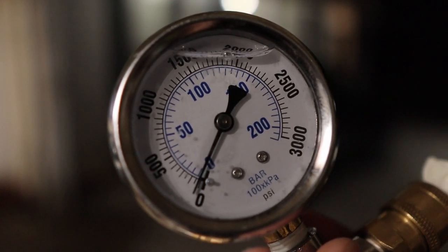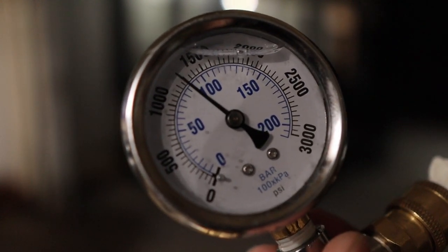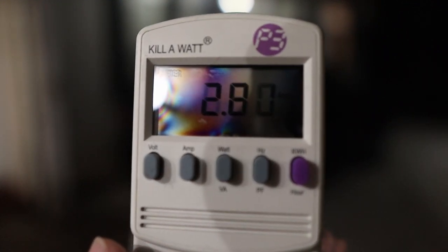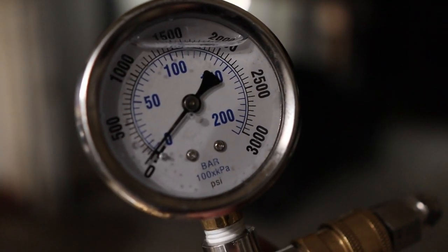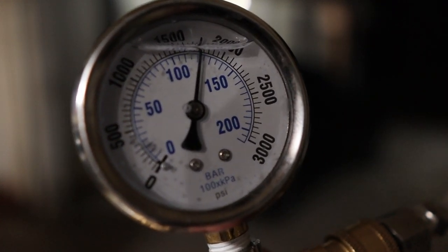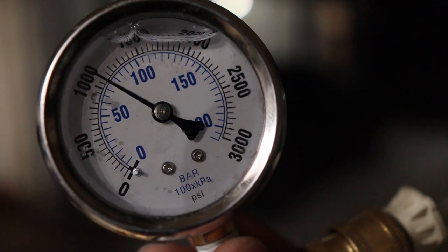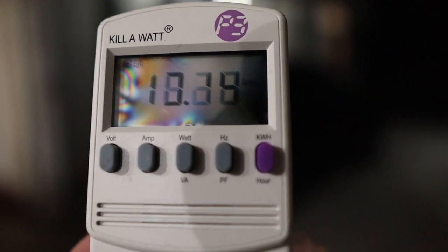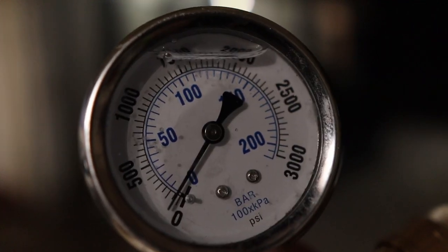This is rinsing a whole lot better and gets the soap off a lot easier. Now we're testing the stock orifice and stock gun — I'm unsure of the orifice size on this. We're getting just a tad over 1300 PSI — I'd say about 1325. Here are the amps. With the 1.0 orifice nozzle drawing 11.3 amps, here's your 1700 PSI. With the 2.5 nozzle we got 1100 PSI. Here's the amperage — 13.2. Here's the 3.0 — that's about 850 PSI.